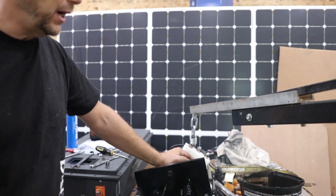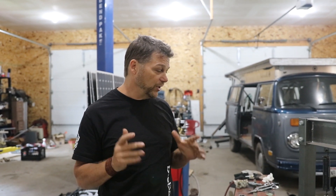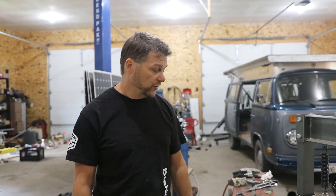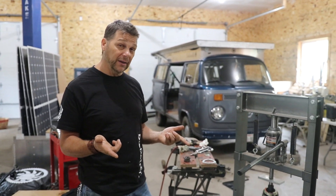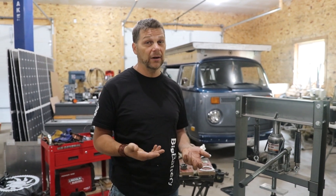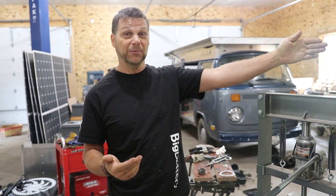I just went through the lower unit on the Mercury motor. We realized we don't need a mechanical reverse on the outboard motor because we're not running a gas motor which only spins in one direction — we're using an electric motor and with a flip of a switch we can go from forward to reverse. What we want is a pretty much direct connection, a lot less moving parts, a lot less things to fail. Some of these older motor parts look a little marginal, so we're going to weld this solid. The weak point of the system then becomes the blades on the prop. What's cool about being solid is when we slow down we're also going to get regen — as the boat moves through the water not under power, the water's going to spin the prop backwards and basically charge your batteries. Kind of like hydro power.